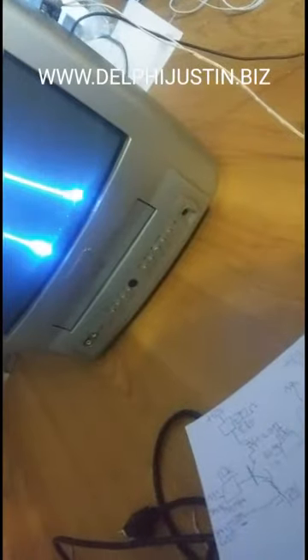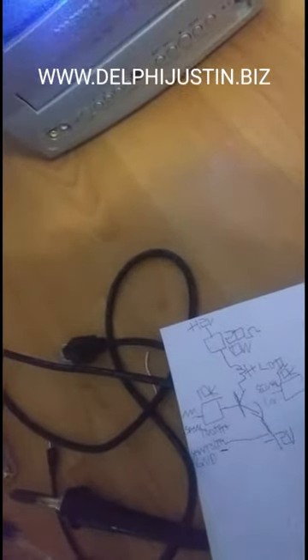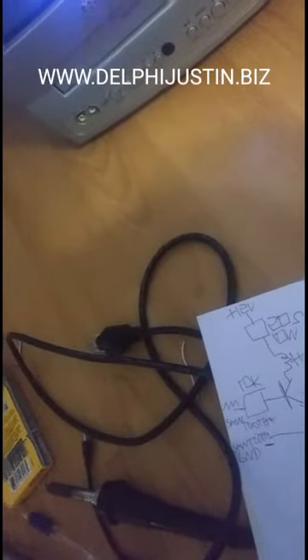What we'll try to do is make it better by doing that. I've got a tiny breadboard - it's ideal to use a breadboard because then you can unhook the wires from it. The wires will hook into the breadboard and then hook to the op-amp. If you don't want to use an op-amp, you could add a variable resistor between the push-pull at the highest resistance you can get, which would let you vary the impedance, but the waveform might end up very small.